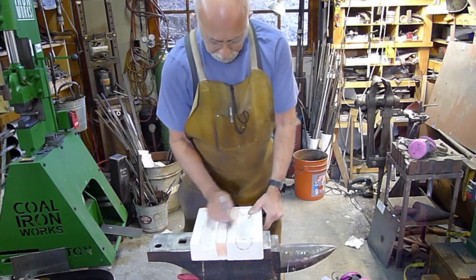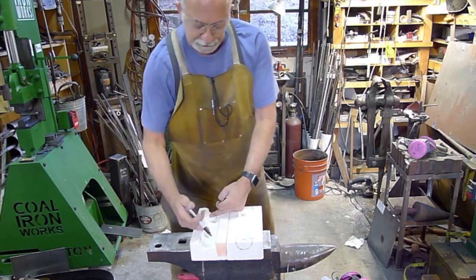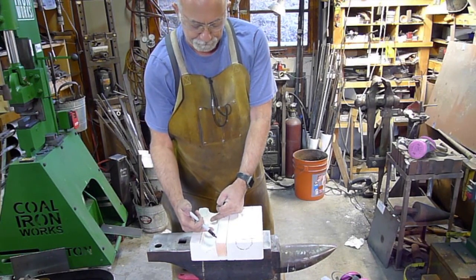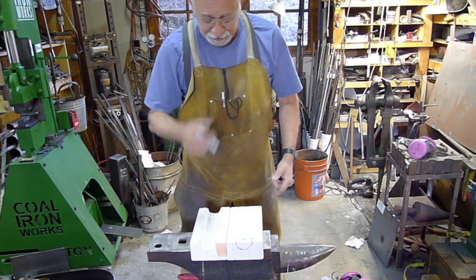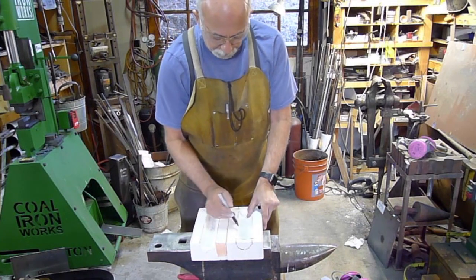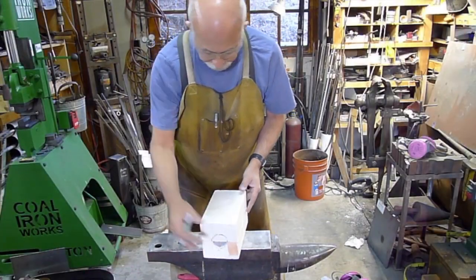The torch — first of all — we want it to go in and swirl in this cavity a little bit. We want it to get an area in the center hot. We don't want pinpoint heat or just the torch blasting directly on our piece — it's going to oxidize it. So I'm going to bring it in through the top piece and angle it back about this angle. Let's make sure I've got the right side — yeah, because this is going to be the front.